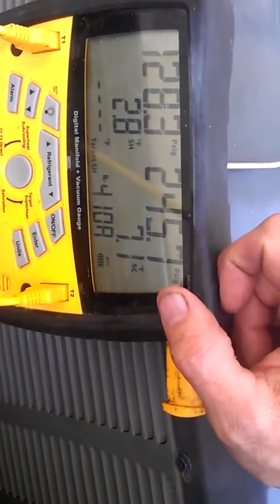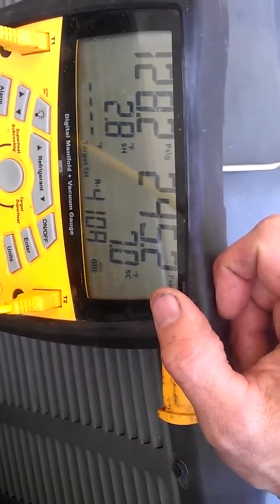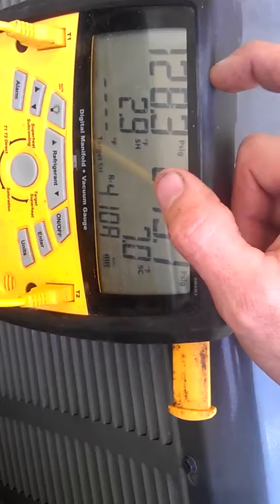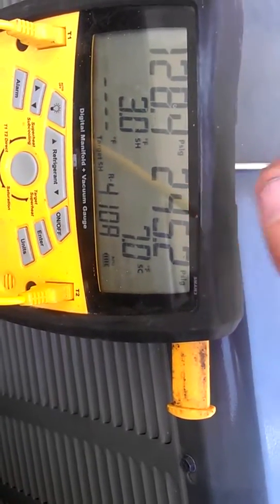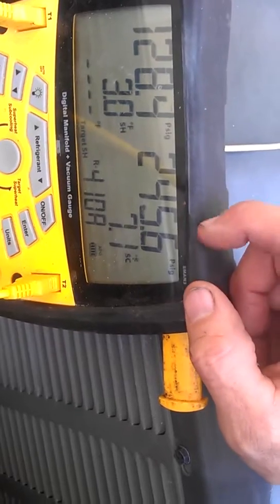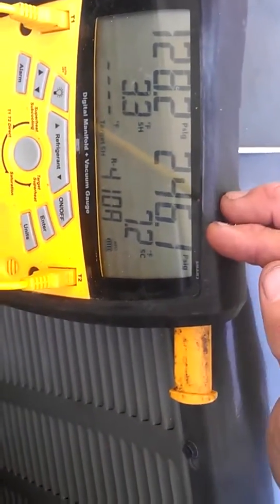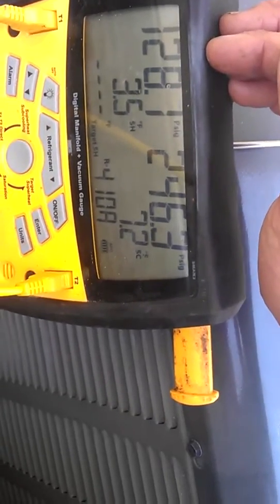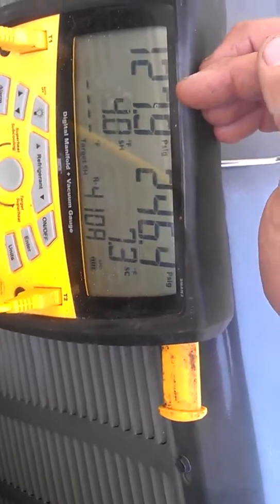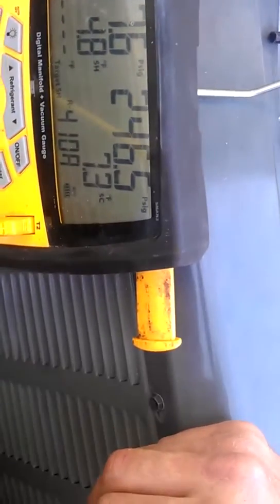Of course, our superheat goes up and down, and if you get within three degrees of it, you're doing good. It was standing pretty steady at six degrees superheat, so it should go back there. Our subcool should be something like eight degrees — seven to nine on the subcool, five to seven on the superheat. You adjust that TXV — they've done away with that, which is a good thing. And subcool should be in there perfectly.